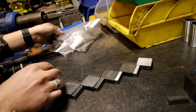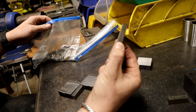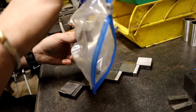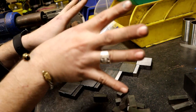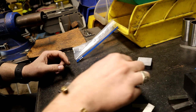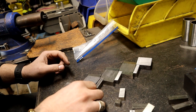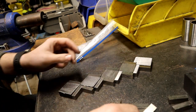Then what I've done is I took a second billet. Now this billet, this was pretty unique. I did kind of an explosion pattern, if you will, that I highly altered. So it's not just standard explosion. I kind of made little flowers out of it. So instead of the pieces just coming out radiating like normal explosion, these pieces kind of create little flowers. And I reduced this down to about 3/4 of the length of the initial bar. Those will get stacked here on this piece. Like that.